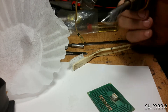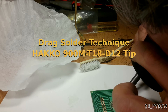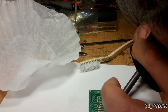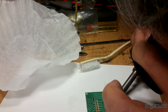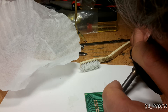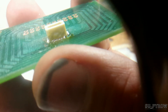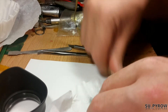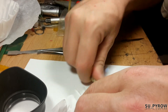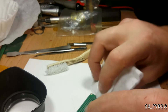I'll touch it, and I need my eye loupe for this job. I want to clean that up and do one more inspection on it. I'm not sure, but I think I saw a little bit of a bridge in there. You've got to clean the connection to be sure. Then we do a final continuity test, and I'll finish the rest of the boards off camera.